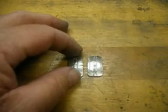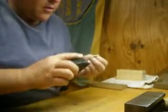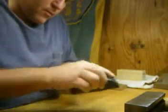We're going to go back with the 320. For this particular type of metal — this being a German silver — 320 will be fine. We're going to give them a light sanding and then we're going to make the loops. After it's soldered and cleaned a little bit more, these will be ready for the buffing machine.